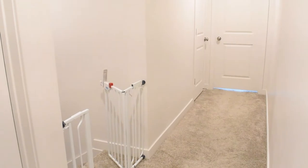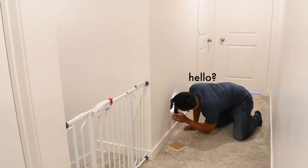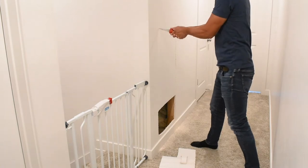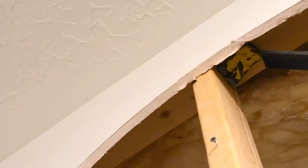Here's where I want to have the shelf. I found the most hollow sounding point, cut a small hole, flipped on my light, poked my phone in — I wanted to see what was in there — and kept making bigger holes until I got to this. As you're cutting, you want to make sure that you're not going to cut any pipes, electrical, or air ducts. In this case I got lucky because of all this dead space, and I removed this middle stud.